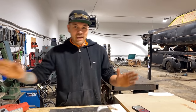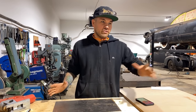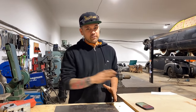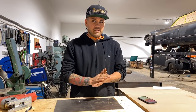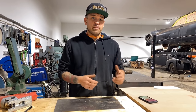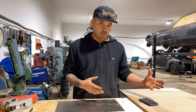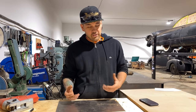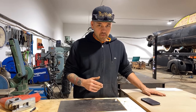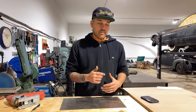Today's video is all about curved flanges. I'm going to do a demonstration comparing the bead roller versus hammer forming — pros and cons of how to make a curved flange. Bead rolling works great but the thing it doesn't do is shrink or stretch. After you bead roll a flange you have to shrink or stretch it, whereas a hammer formed flange pretty much holds it tight enough that the shrinking and stretching happens within the hammer form.